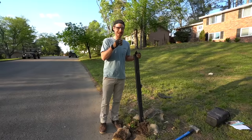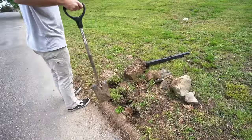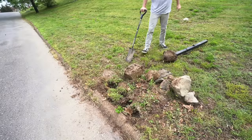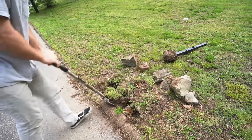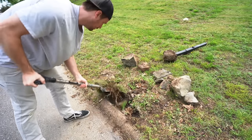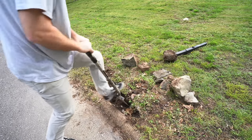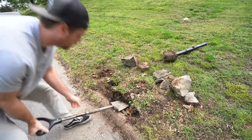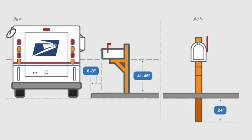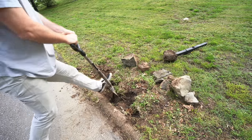And this is our mailbox now. Where do you put mailboxes? That's a great question and we will figure that out eventually. In the meantime, we need to come up with some dimensions for this mailbox. I do know that we're gonna place it exactly where our old mailbox was. For our concrete base, it's gonna be one foot by two feet. According to the United States Postal Service website, they recommend your mailbox being at minimum 41 inches high up to 45 inches high and then about six to eight inches back from the curb. Those are the guidelines we're gonna follow.